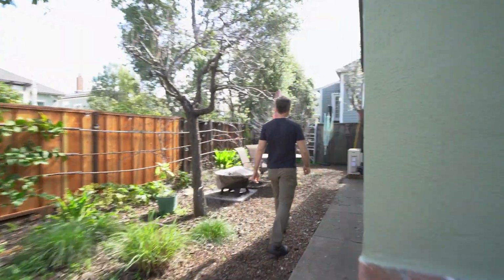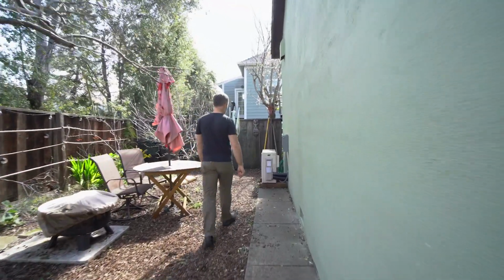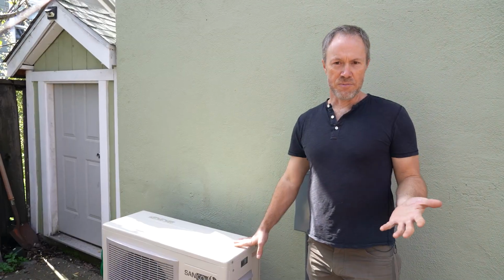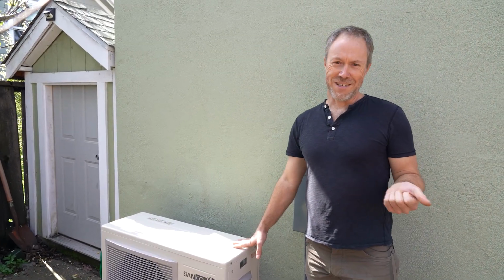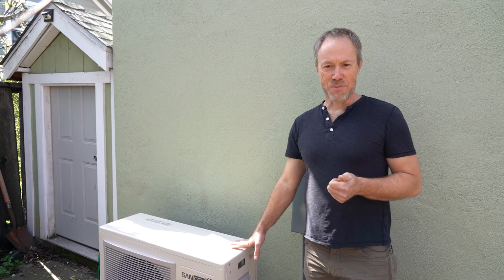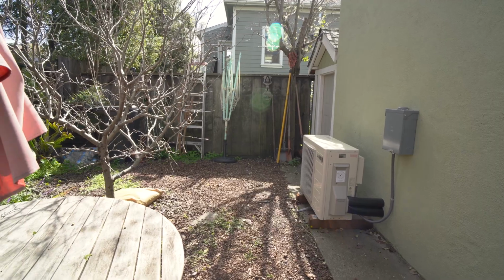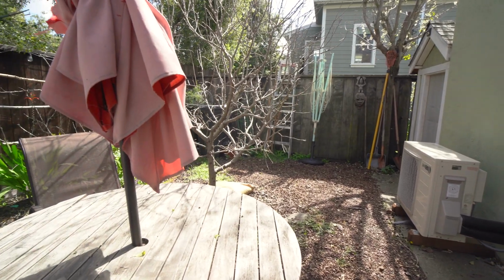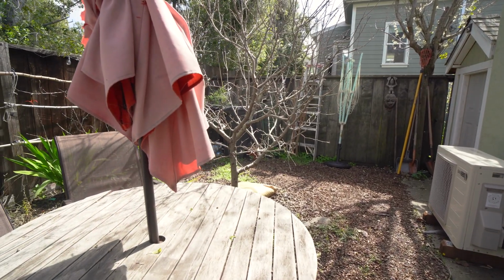This is a 4-unit building, and we have a small HOA, so after I had finished electrifying and insulating my apartment, I wanted to replace the water heater that we share. That required me to get buy-in and permission from 3 other owners, but I did. I persuaded them to put in a pretty expensive system, and part of the way I did that was by the rebates that are available for heat pump water heaters.